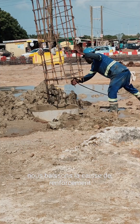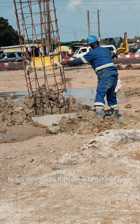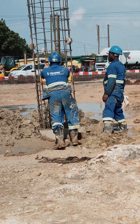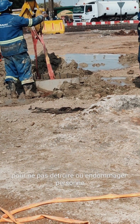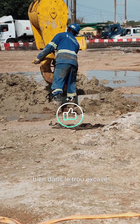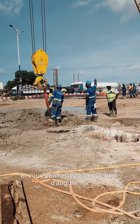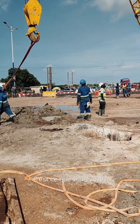As you can see from this video, we are lowering the reinforcement cage into the steel casing already in place. We have to lower it inside so we can start casting the concrete. The machine is now lowering the steel cage, and it has to be done very carefully and meticulously so you don't destroy anything or hurt anybody around. You need a good rigger to direct the machine to place the steel cage nicely into the excavated hole. After that, you remove the material used to hold the steel cage, then allow the machine to lift up and leave the facility before casting starts.